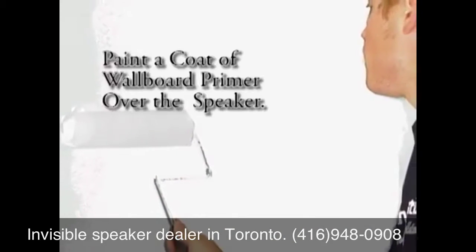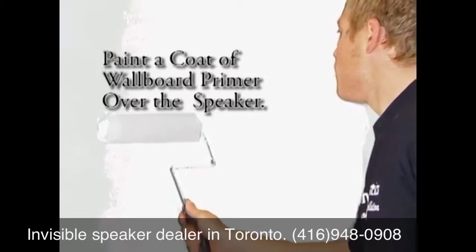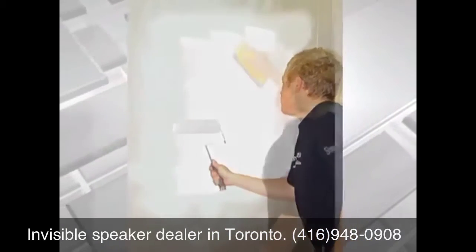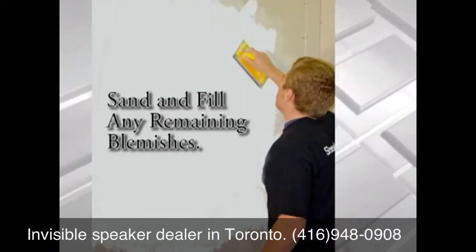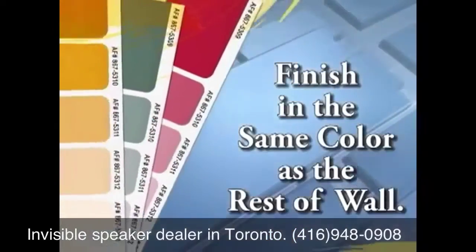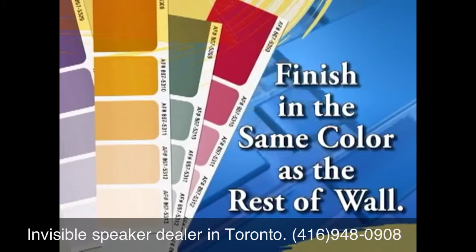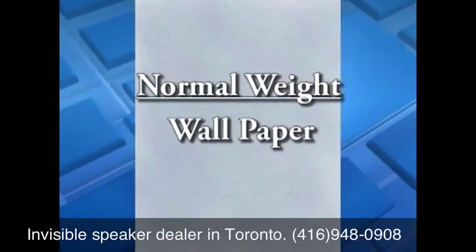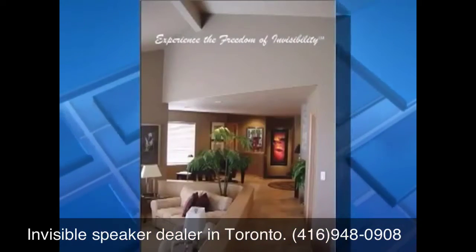It's a good idea to then paint a prime coat of wallboard primer over the speaker, which helps reveal any remaining blemishes. Fill and thoroughly sand any remaining visible blemishes. The speaker installation may be finalized using the same color materials as the rest of the wall, including light texture paint or normal weight wallpaper.